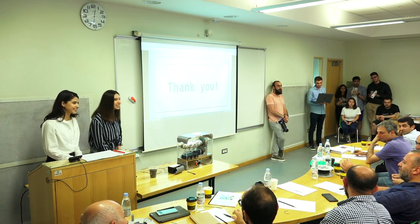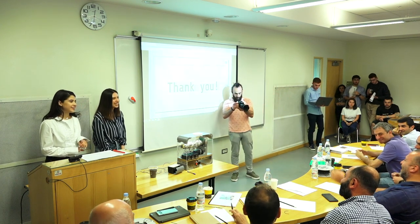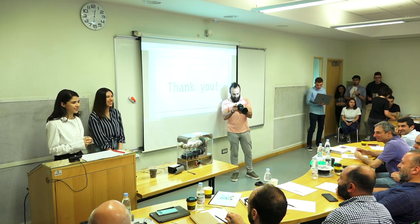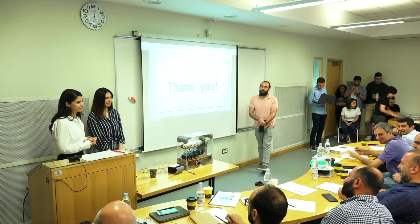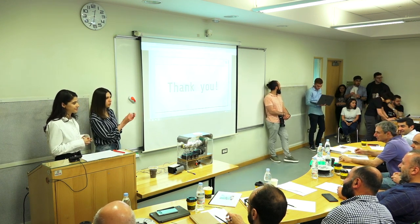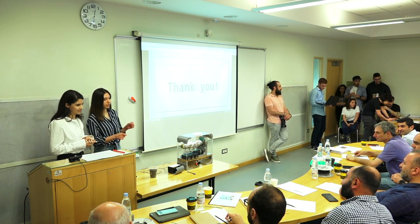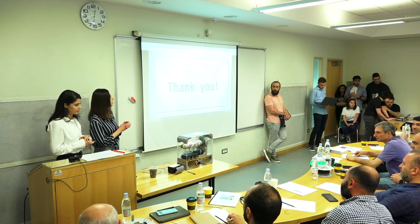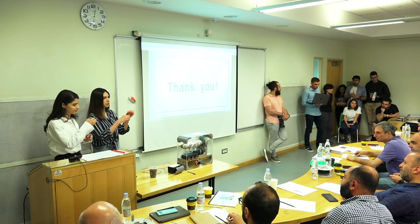Question: have you done any printing? We were afraid to do that. We didn't. We couldn't get the constant diameter. That's why we were afraid to experiment, because we didn't have the puller module, which provides the constant diameter. So we wouldn't get it by manual spooling. We would get different diameters, so we were thinking that the extruder inside the printer wouldn't be able to catch the filament.